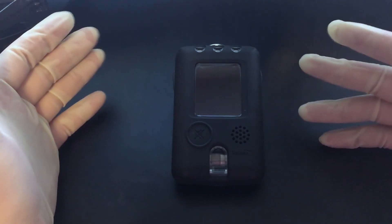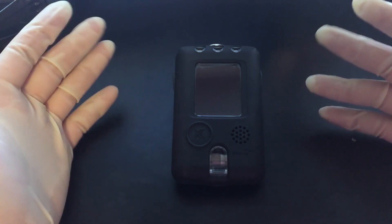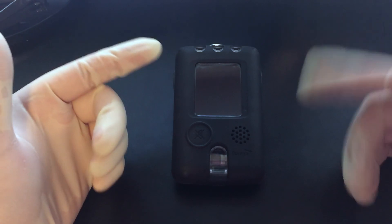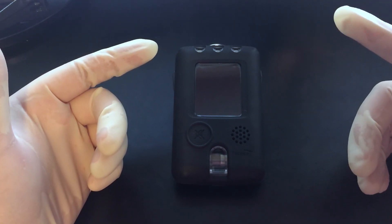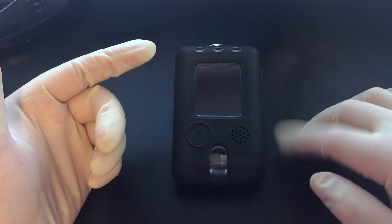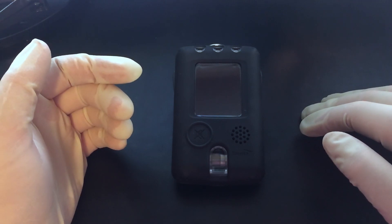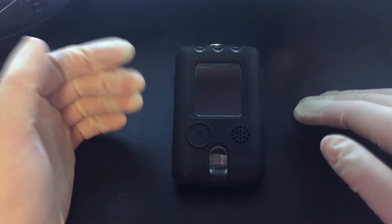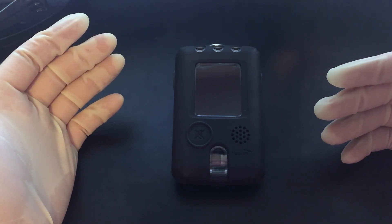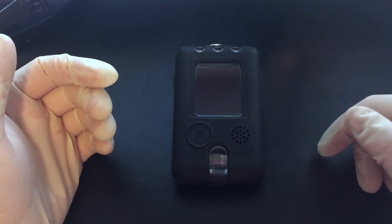I'll be doing more videos on meters. Right now I have sent off my nice Ludlum - I'm getting a new Ludlum 3001 unit and I'm calibrating it with the pancake probe with the dose filter and without the dose filter. And I'm calibrating the 44-2 scintillation detector for take-up three of the instrument settings, because it is a multi-instrument unit. So you just plug in the instrument, select which configuration you want, and it will work with that calibration. It should be an extremely cool unit. Unfortunately, they have a long wait time right now, and since I'm in the process of moving, I don't need it. I ship my instruments off to them to get calibrated and to get that new meter calibrated with my sensors. The fourth slot on that 3001, I am hoping to get a neutron detector eventually.